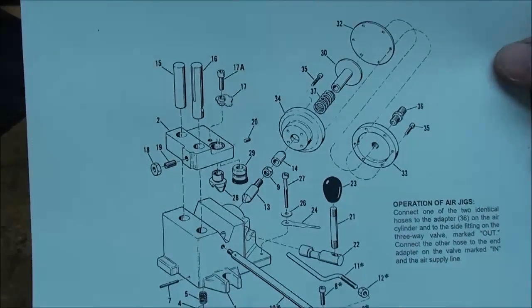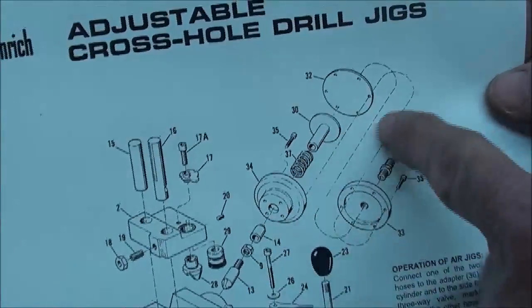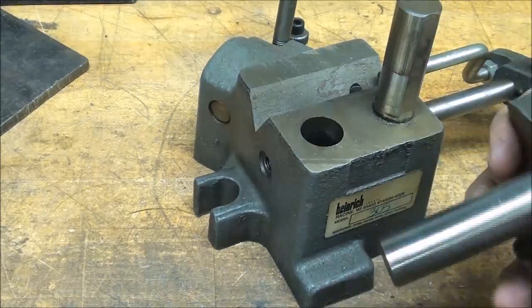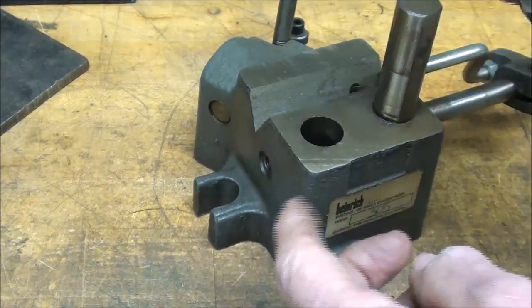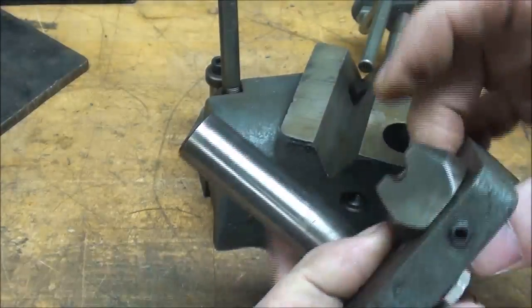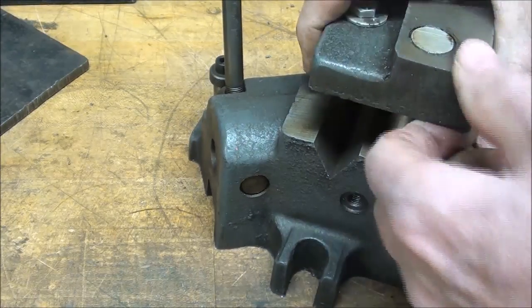If you want to see how these are built and the different parts, take a look at the website. I just printed out this exploded view here, which I like to look at. You can see the different parts — it's also made with an air cylinder — and this parts breakdown covers both the manual and air operated versions. Taking this off, you need to loosen this screw. You can see what it looks like underneath — this is called a liner V adapter. Notice that it fits down into the V slot here. So this is really a V block. And now you can see why the length of the bushing is critical.